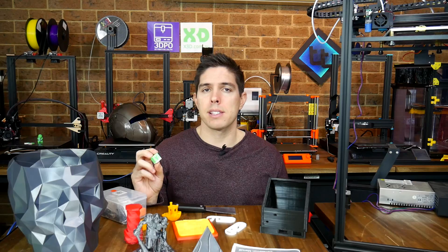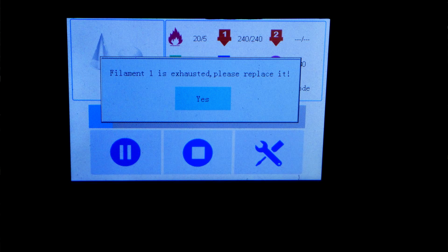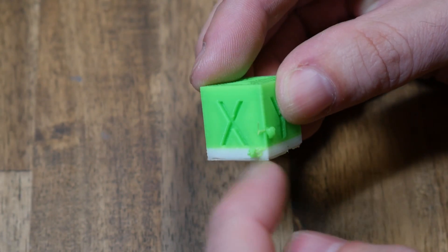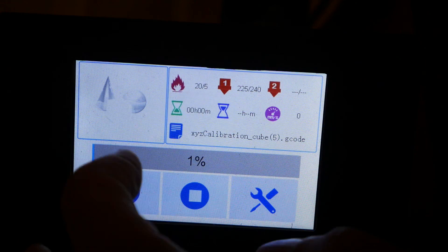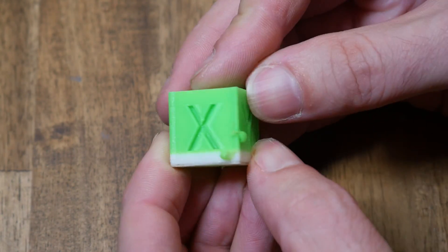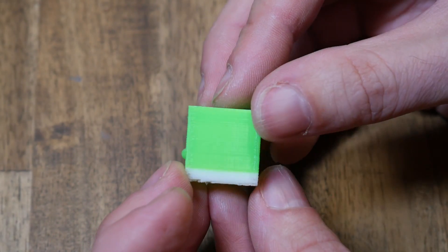Finally, I repeated my cube tests to test filament runout detection. I'm pleased to say this went without a hitch — I got a message on the LCD, changed the filament, and it resumed from the correct position with the transition being pretty seamless. After another 5-10 minutes, I pulled the plug. Once again I got an appropriate message on the LCD, and when I hit yes, the print continued where it left off — again pretty seamless, apart from the blob that oozes out when the power is cut.